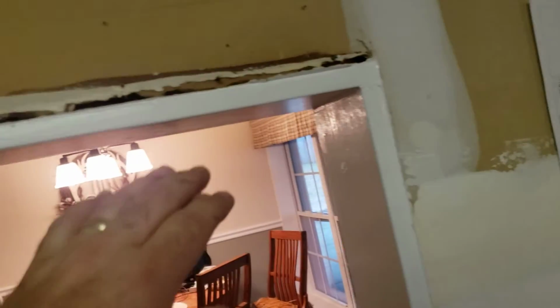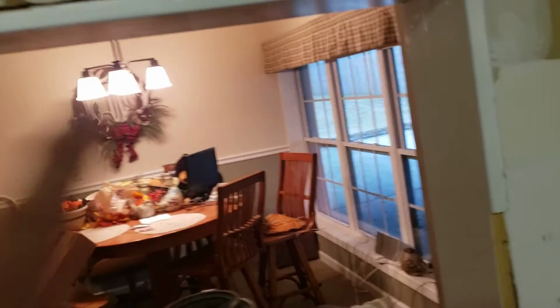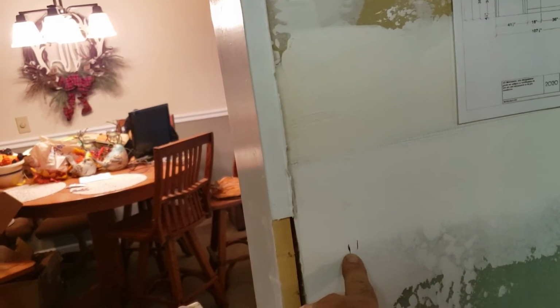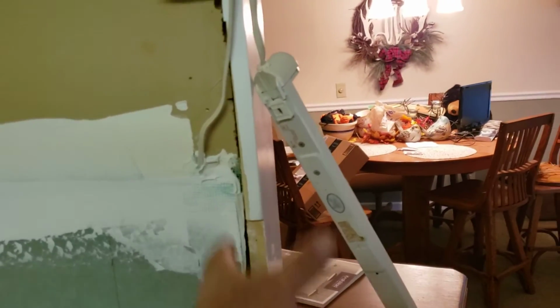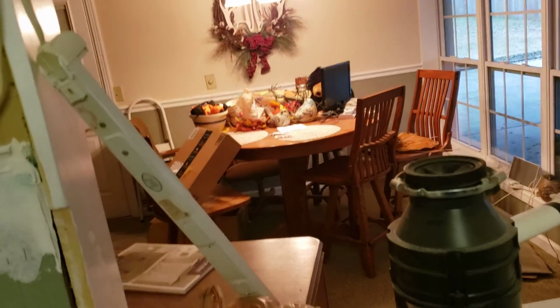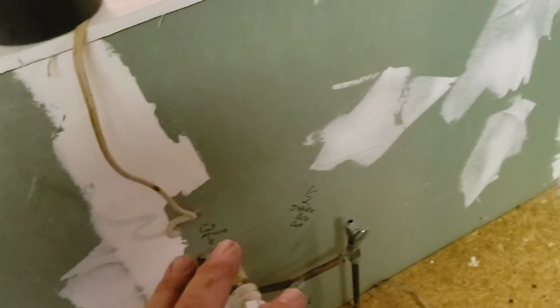But the other thing is the moldings that are here are proud of the wall, about a 1/2 inch. So he's wanting to have the other gentleman that's working for him take and cut this off and smooth this up even with the wall, just like this has been done. So regular casing can be fitted here as far as the molding application. Our cabinet is going to stop about 2 1/4 inches back from the edge on both sides. So a regular 2 1/4 inch casing will fit here, or a shaker block style, craftsman style casing, the 3/4 inch block style casing. I believe that's everything we have for this one.